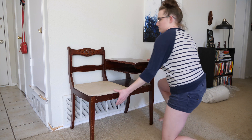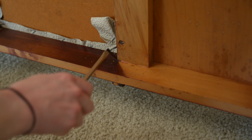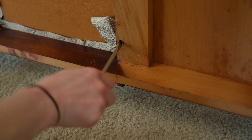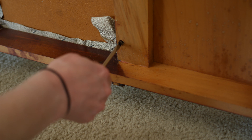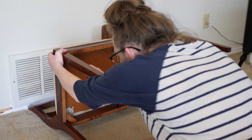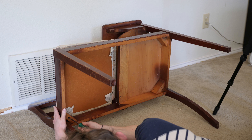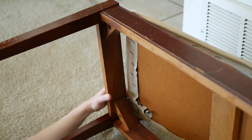Clear off your table and turn it so that you can take out the screws holding the seat to the table. You'll need a variety of supplies and tools for this project. You'll need the correct size screwdriver to remove the screws. I will also be using a small flathead screwdriver to pry up the staples. Grab a pair of pliers too. You'll need a staple gun to attach the new fabric to the seat. The staple gun I have is not very powerful, so I also have a hammer to pound in the staples.